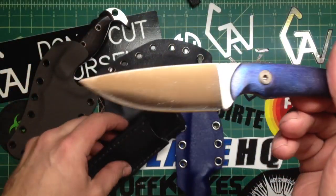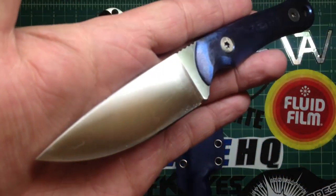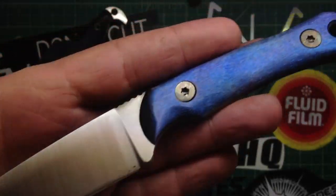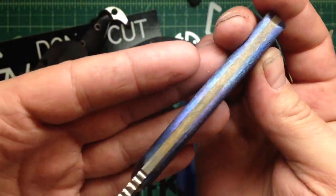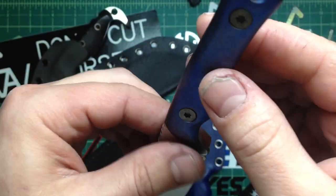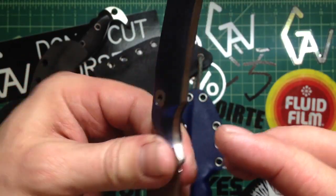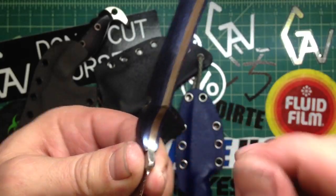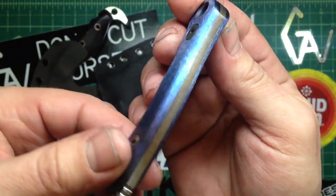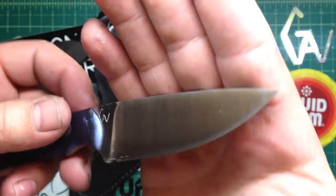This one is pretty sweet — it has a very, very pretty satin finish on the blade, like really nice, like perfect. And that really cool handle — I heat anodized the tang. It was a tricky one: holding the blade in cold water so it doesn't warm up or even get hot, holding it with my fingers making sure it's still cool, and with the torch flaming that part of the tang. It was kind of funny but it worked out — just to change the color a little bit so it goes kinda like blue, gold, blue, but then goes to a nice, really shiny, very pretty finish.